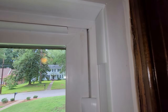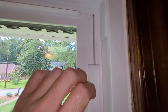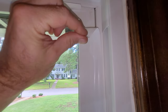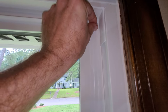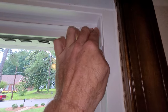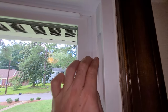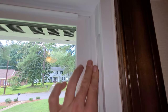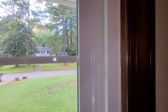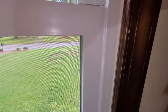You can see the gaps that start to open between the window and the window frame. Just take your tape, cut it to length, put it up, and fold it over. Press it in place — don't stretch the tape, just lay it on there and press it on. It provides a seamless seal along your vinyl windows, and may work on wood windows as well if you have them painted white.